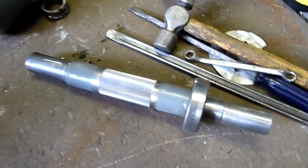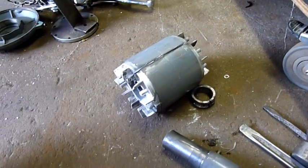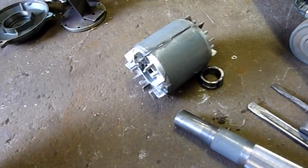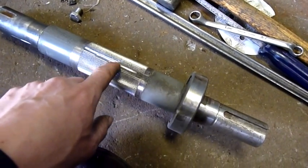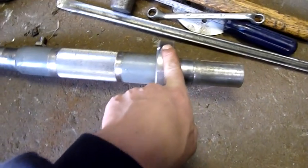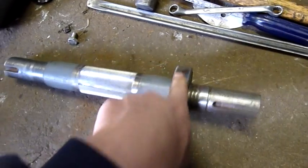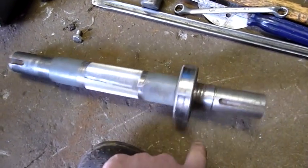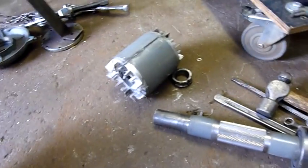It took a little longer than expected, but only because there's aluminum through the laminations — I had to keep oiling it to make it easier to cut the alloy out, but it went through pretty well. I split it down to pretty much where the key slot is, and there's a little bit of a gouge in the shaft, but that's alright — I'm going to turn that smooth anyway. The bearings are already pretty rough, so I'll re-wash and re-grease this one for now, but ultimately I'm going to need a new main bearing. It'll do for mock-up and test run purposes — there's a decent bit of shaft and it should work quite well.